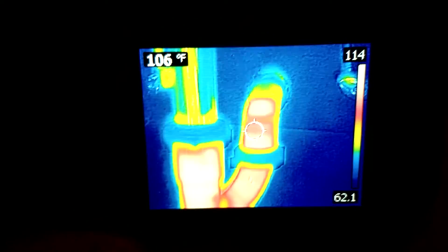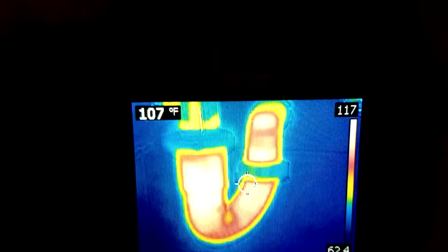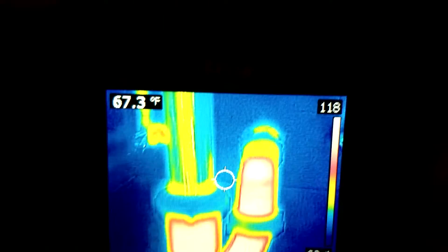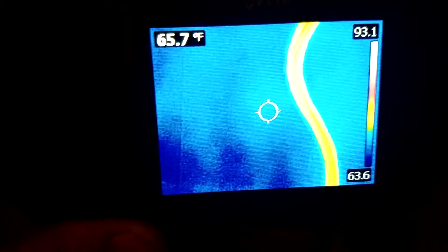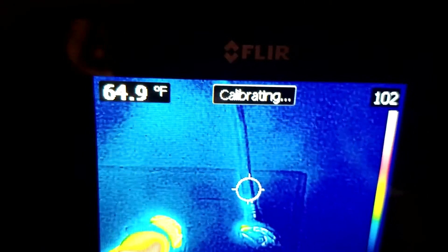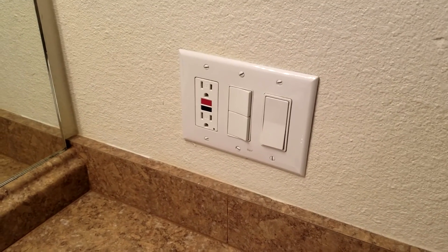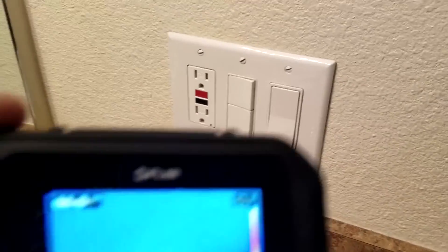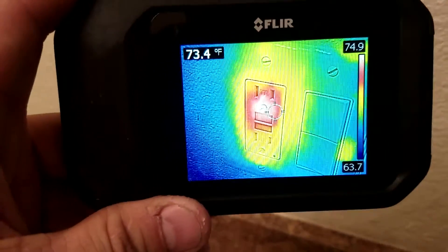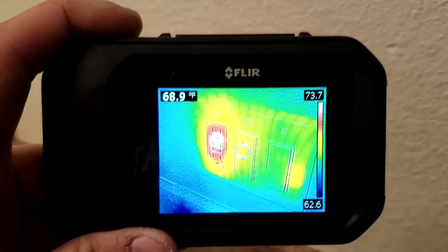One thing that might be obvious to some and not others: if you have a clog in a drain, you can run hot water down it and the glowing red area will stop where the clog is, letting you locate where in the pipes it's happening. While down there you can also see the hot water line and cold water line. Another use — GFCIs actually consume power, and you can use the thermal camera to see the heat they generate, showing that they're using a small amount of power. It's probably negligible, but it's a fun way to see what's using power and what isn't.